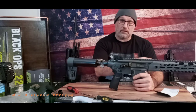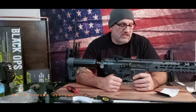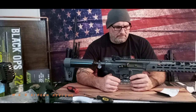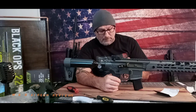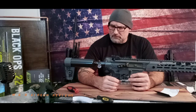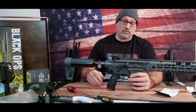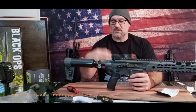This is a machining issue — and also those barrel screws weren't tight. Put some Loctite on your screws if you're going to tighten them. These guns are built in Japan, I believe, and usually things built in Japan are pretty good, so this is kind of disappointing. There are a lot of rifles out there having these same issues. Sig did address the trigger binding issue on the inside, and my trigger's nice and has a decent pull — we'll get to that later. But these issues are simple to fix. One quick Google search and I found tons of guns having this problem — barrel accuracy problems, trigger jam problems.